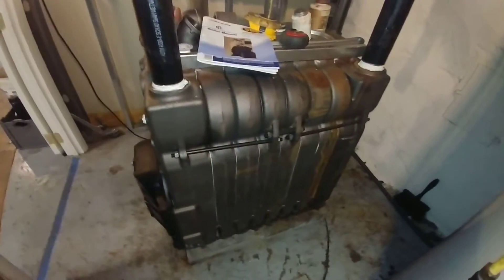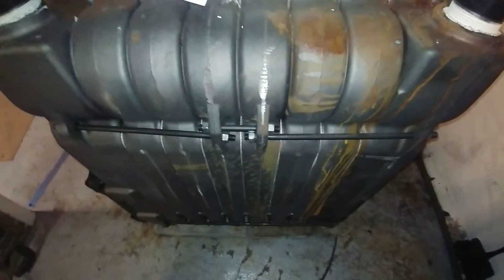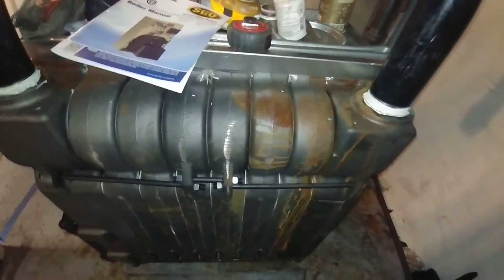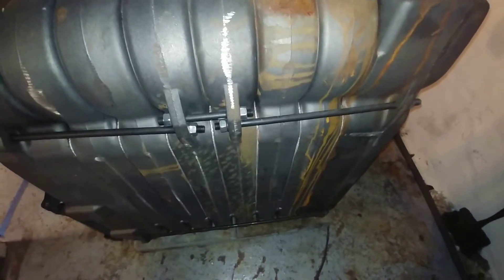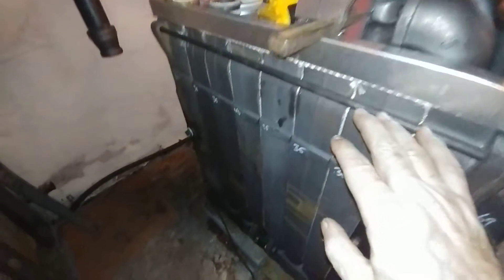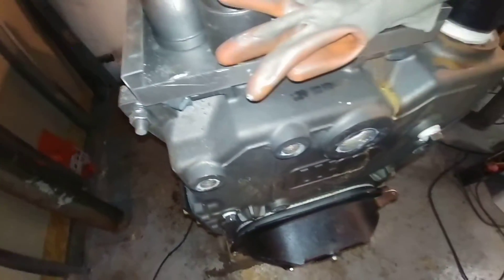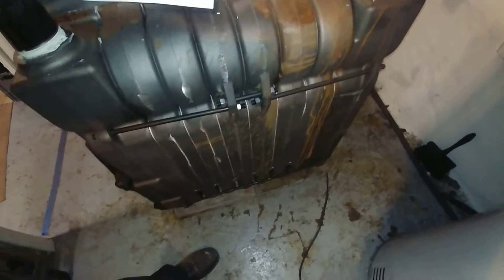This is an eight-section unit — it goes up to nine sections. One advantage of this particular model is that it can be shipped knocked down, like this. There are the jackets. Another big advantage for anything above seven sections is that it can be disassembled in the field. You remove this rod here, the bottom rod, this top rod, and this bottom rod, and the block then splits so you can carry it in in sections — which was necessary given the pretty tight squeeze in here.